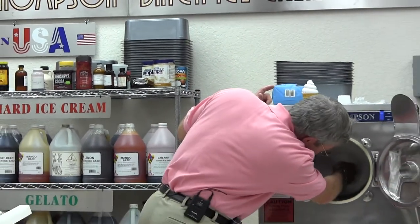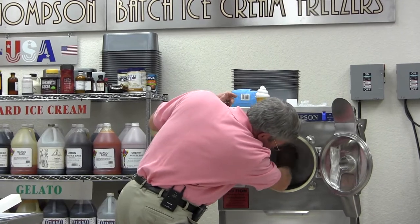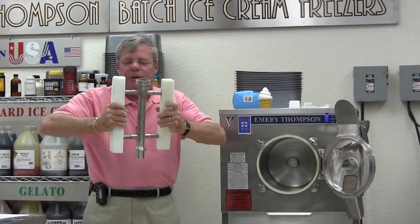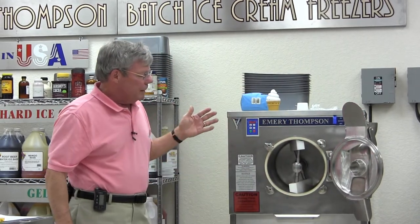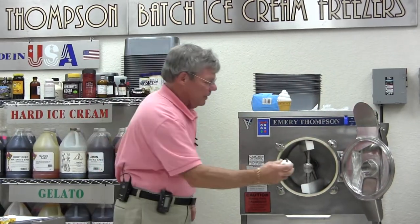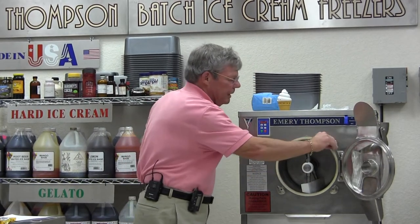The dasher just slides into the back. Any excess Vaseline is going to be pushed forward, so I'm just going to go in here and wipe that off. Then that's ready to go — I put the dasher in. All I do is check that the blades are curved in the back, squeeze them together a little bit, and put it in. I'm just turning it around until it picks up on the dasher. When I think it's on the dasher, I give it an extra turn to make sure it's all the way in. Then this little bushing goes on the front — it's got a little stainless steel piece that sticks up and goes in.